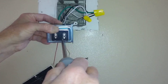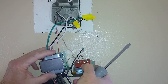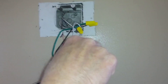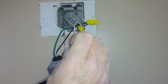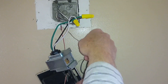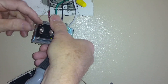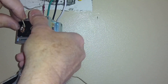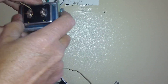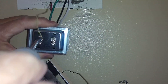We're just loosening the screws here on the new transformer so we can secure the wires. We've got the old transformer. Just as a reminder, make sure you've flipped your breaker so you don't have power here. We're just doing it one by one so it's easy to keep track of what goes where. Always consult your electrician if you have more detailed questions. We'll wrap that around there, make sure you've got a secure connection, and then tighten it up so it doesn't come loose.